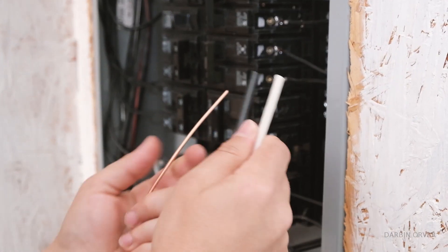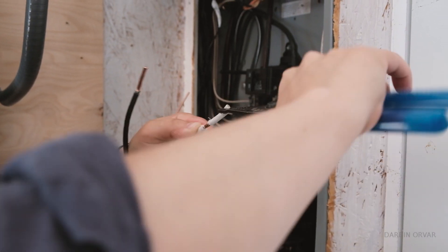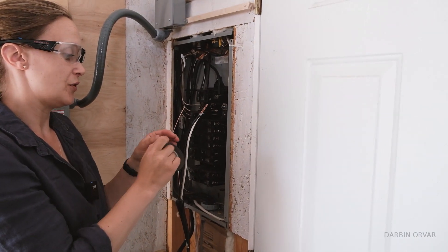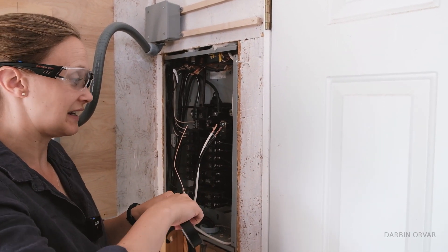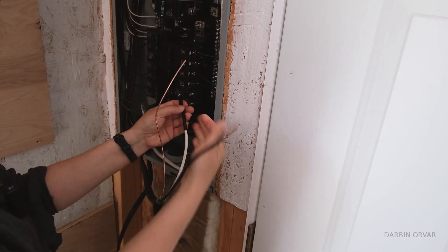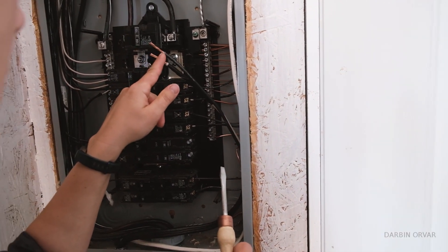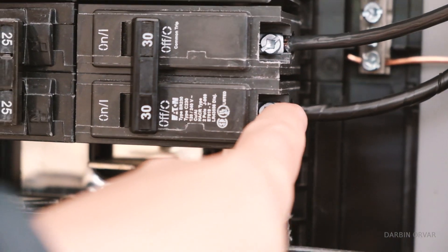I've got my wire here, so I'm going to strip a little bit of these. This is stranded wire — you can see how they're twisted a little bit. You don't want to untwist them, keep them as they are. Since we're doing 240, these are both going to be hot. You want to make sure that anybody who comes looking in this box at some later date understands that, so I'm going to add some black tape to the white wire to make that clear. Since these are both hot, it doesn't matter which one goes into which terminal. I've got the ground plugged in right here. In this situation we're not going to be connecting anything to the neutral — we're going to have two hot and one ground. Both hots are now connected to the breaker, as is the ground.